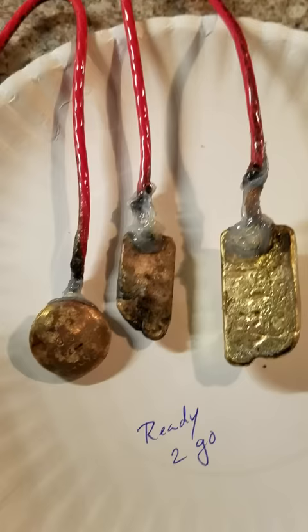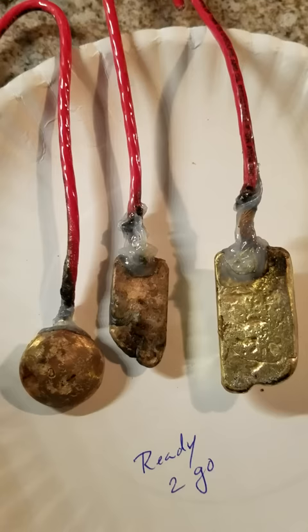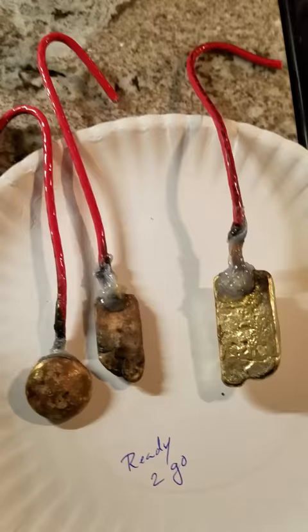Using a salt water electrolytically charged cell — basically a container with water — using the anode and cathode: positive to the anode. This is where the metal would hang with the positive charge, to be dissolved over to the cathode, which is the negative side of the battery.